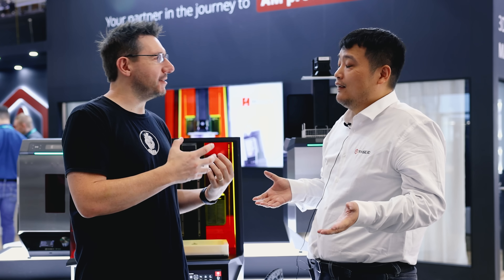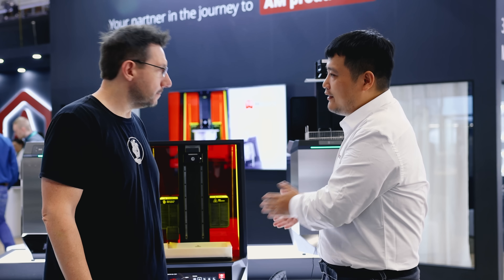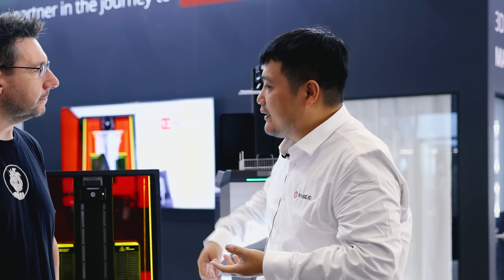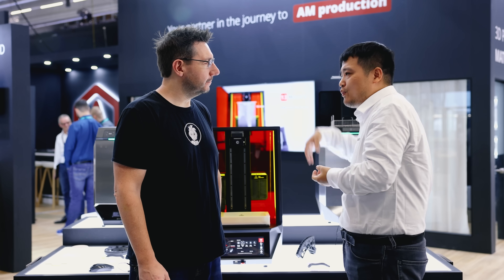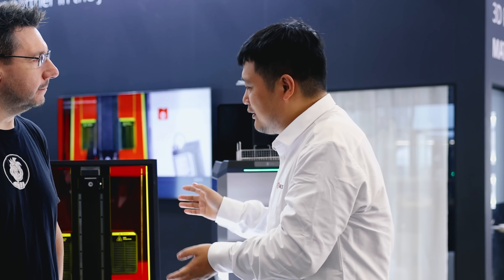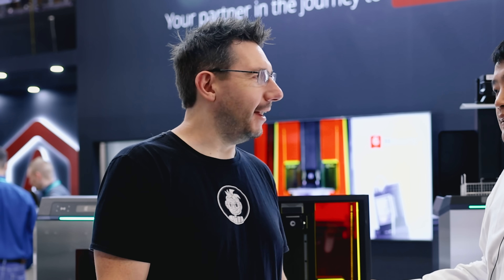That's fascinating because that's really more similar to what a factory does. There's a receipt, essentially, that travels with parts through an assembly line — and that's cool that you brought that to the resin world. Imagine we have 20 printers and three post-processing stations. If you're transmitting the receipt by network, it would be a disaster for the operators. But the simplest thing — keep it in nature. You just carry the build plate with you, then the post-processing knows how to deal with it.